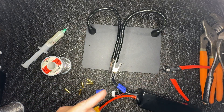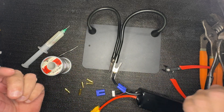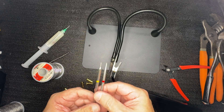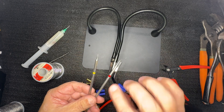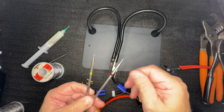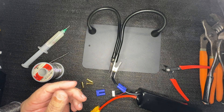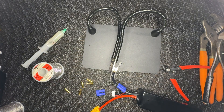This connector works with RF — it doesn't work with DC. The way it works is with induction, with high-frequency induction that is applied to the element, and the element keeps heating until it hits the temperature chosen by the color or type of cartridge you use. The blue one here is for very high temperature, lead-free solders — certain solders used in professional applications that require very high melting temperatures for compliance with some military standards. The yellow one is the normal one you want, and as you saw, the one I just used is also a yellow type — 700 degrees Fahrenheit.